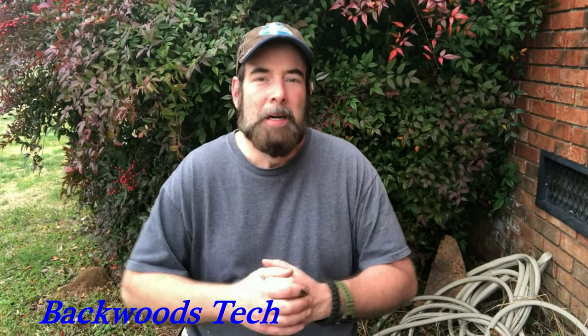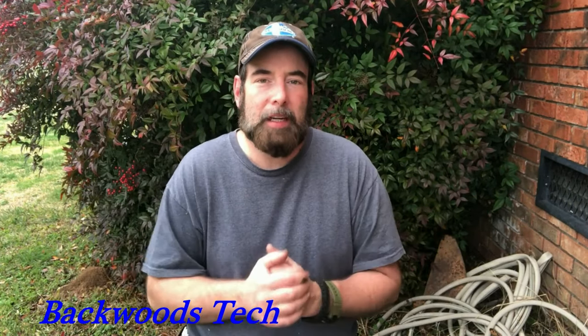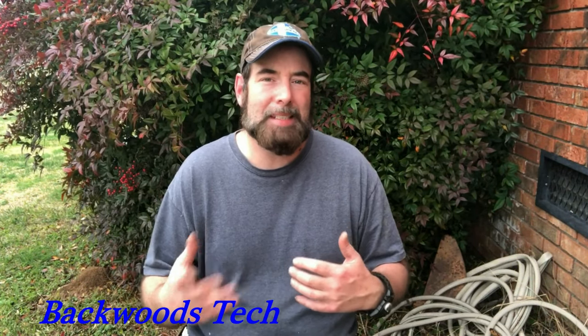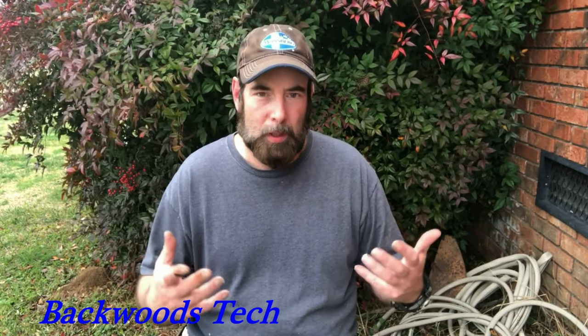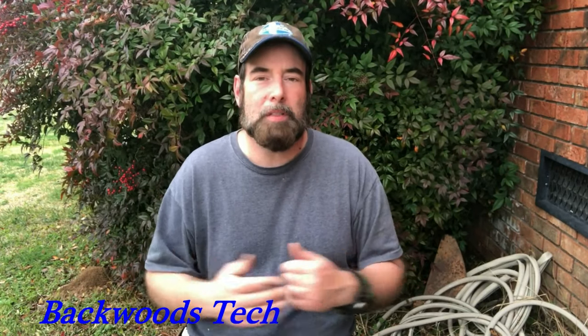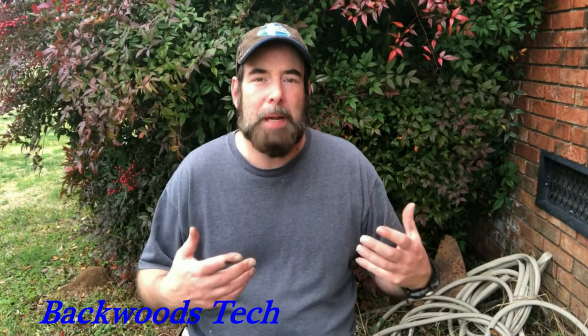Okay, Campbell Hausfeld 115 volt welder and starter kit, if you will. Gotta say I'm a fan. The welder performed great both on the low setting with the 1/16 welding rods and on the high setting with the 5/64 welding rods. Reviewing the components of the kit itself, starting off with the welding shield, a lot of people have complained about it, and I don't know if they've redesigned it or fixed it or whatever. Mine, like I said, it snapped together great.